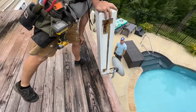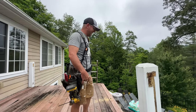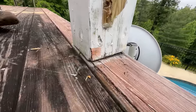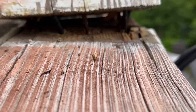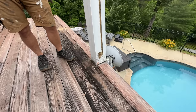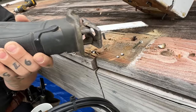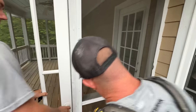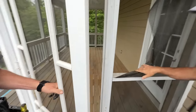That might have some really big screws in it - try going this way with it. Having a little trouble getting that post loose. I'm afraid to move up here because the whole thing is shaking. This post is just screwed down with toe screws - one, two, three, four, five, six, maybe eight screws holding it down. I looked under there and they're timber lock screws, which are giant screws, so it's not lapped into the framing at all. It's actually held up pretty good and it's hard to remove, so that's a good thing. It's got a latch - it's locked inside. Okay, that's one way to do it. That was stronger than I thought.